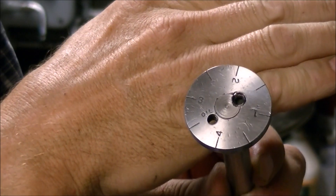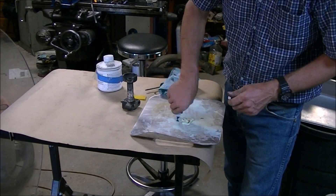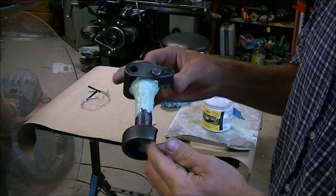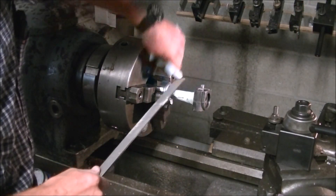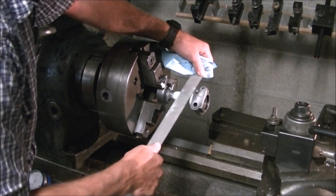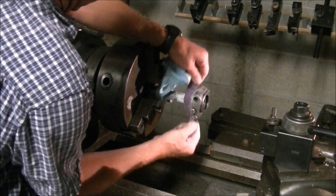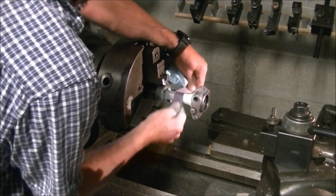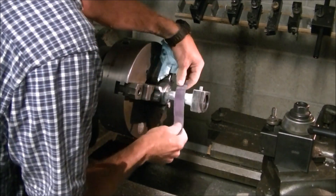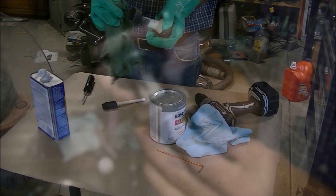The hole did get a little chowdered up with all my efforts so I cleaned that up a little bit. I thought I'd use a little body filler to make it look nice on the old nickel repair as well as my brazed repair. The three-jaw vise made a really nice clamp to hold the part while I worked it over with a file, then sanded it all smooth to blend it and disguise the repair a bit. There's the blended part with the repairs covered up and blended in.